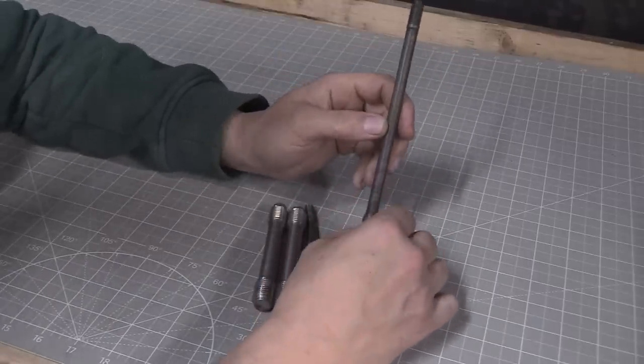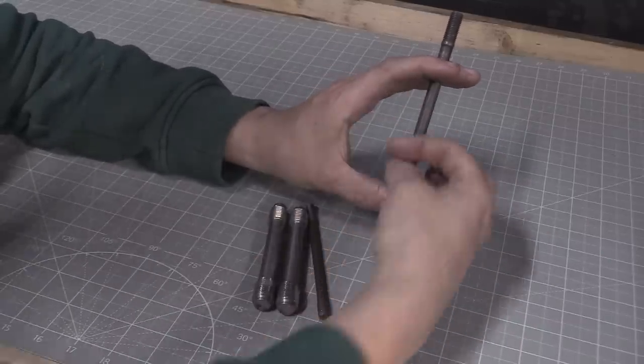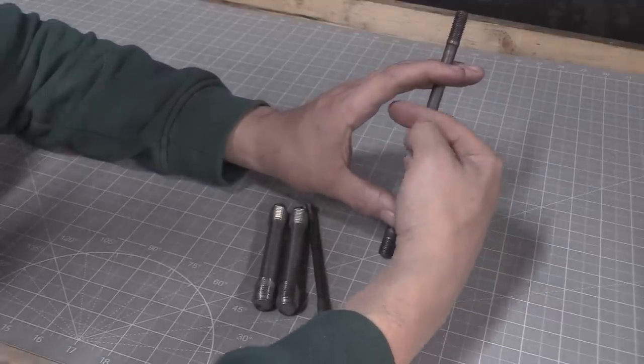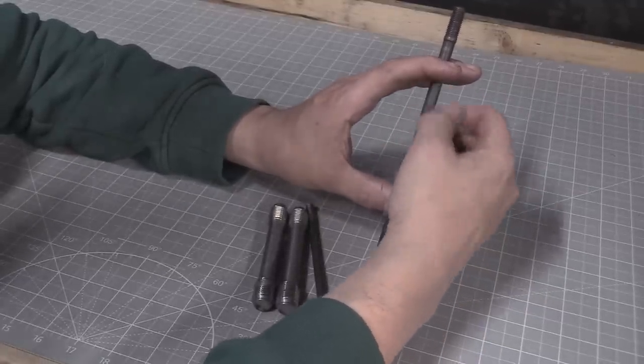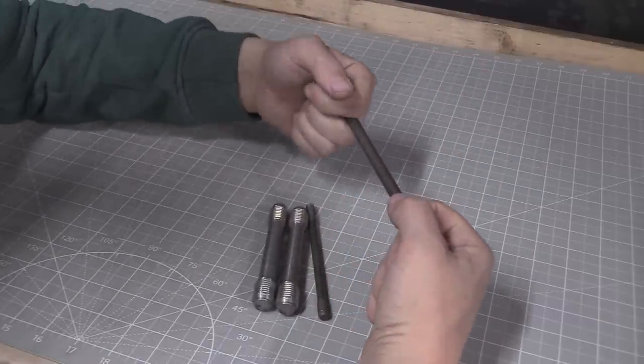Because it's opposing that. And another way you can think about it is inside our cylinder, there's a boom, right? So in here, there's a boom, and it's applying a force top and bottom, down to the piston, obviously, but obviously up to the head. And when that happens, it's trying to push the whole thing off. So this thing is under tension, right?